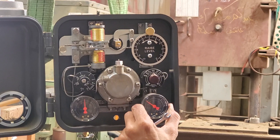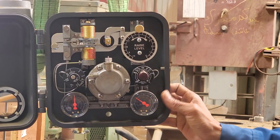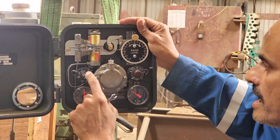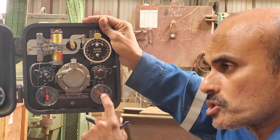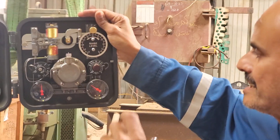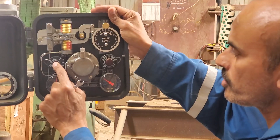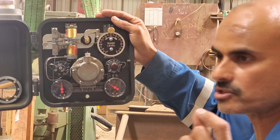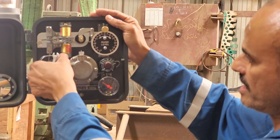Okay, now that's 18 PSI. If you look at it clearly, 18 PSI. So now the calibration is done. As soon as I open this reset adjustment, the indicator should stay at 18, but it will not because there is a slight difference — I cannot check it exactly, I'm not sure if this gauge is okay. But as soon as I open it, I should see it either not moving, or it should go up or down very slowly.